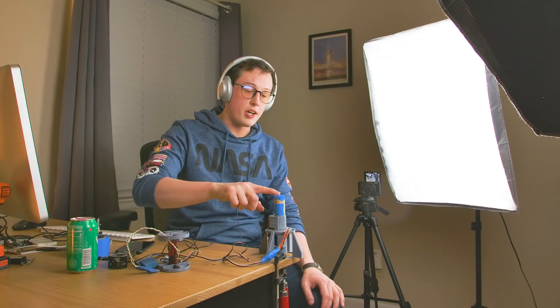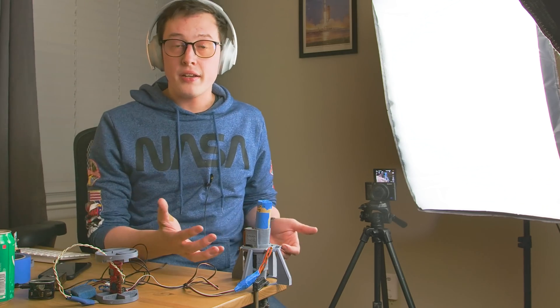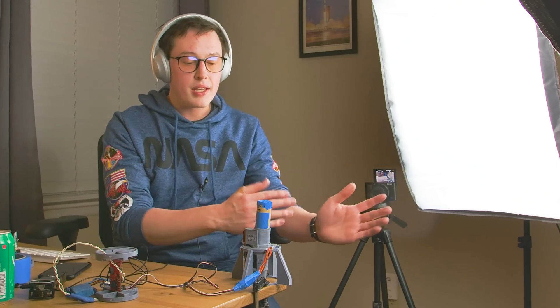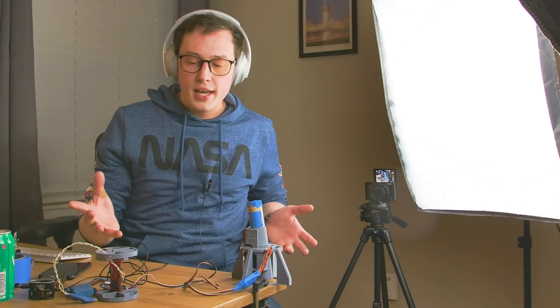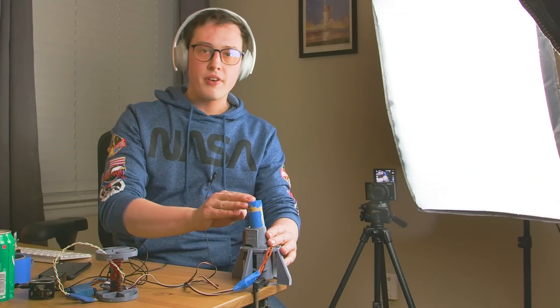So what's going on here is model verification. We have a model or a simulation of how the rocket works. I've got my actuator here — this is the thrust vector control mount, the TVC mount for the rocket. I have some understanding of how these servos respond to a command, i.e., what is the time between when the computer — Signal, this little computer right here — when Signal sends the command to tell the vectoring mount to push five degrees to the side. We need a good model in our simulation of how long that takes, what that transition from zero degrees to five degrees looks like.